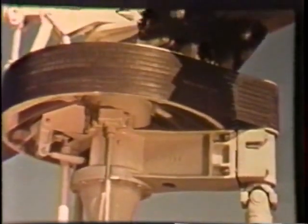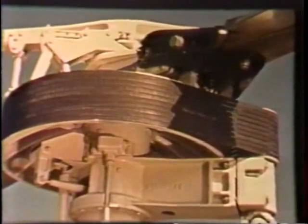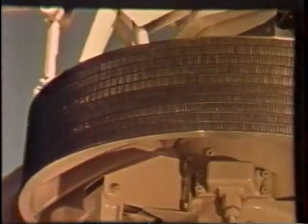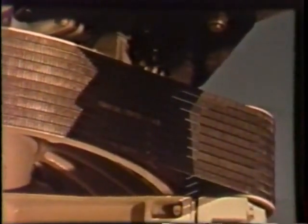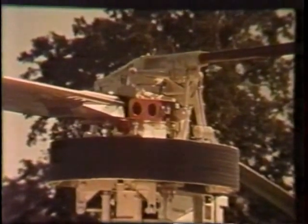Replacing the heavy, costly, and intricate conventional gearbox rotor drive is the B's unique fail-safe power drive — ten rugged V belts with a projected life of 2,000 hours. In the replacement cycle, the belts represent a nominal expense and minimum downtime, in contrast to expensive, time-consuming tear-down and inspection of gearboxes as required periodically.